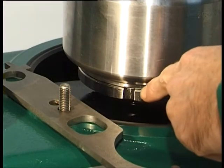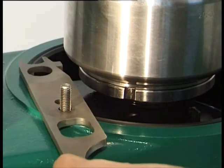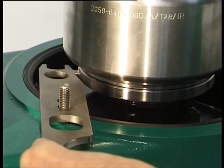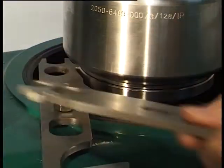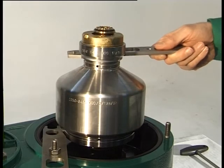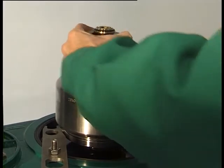Arrest the bottom with the hook wrench and hexagon nut. To do this, place the hook wrench over a stud of the lower section of the frame and let it register in a groove of the bottom. Undo the threaded ring — left-hand thread — completely, using the hook wrench, and screw on one turn by hand.